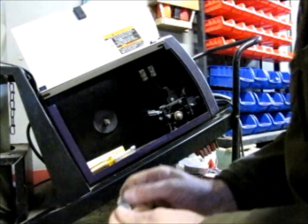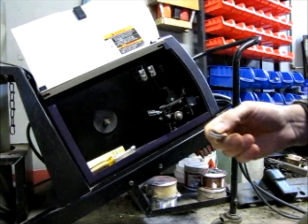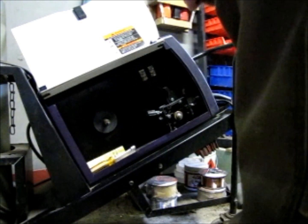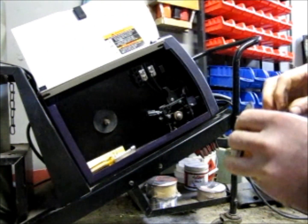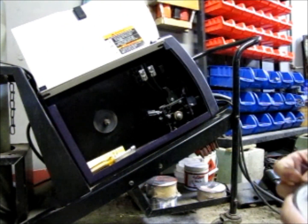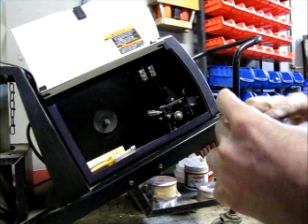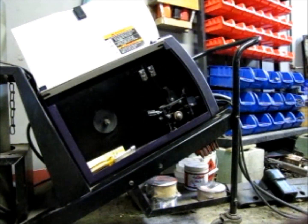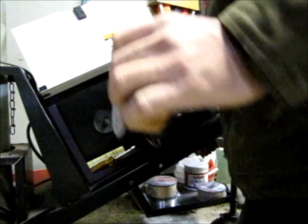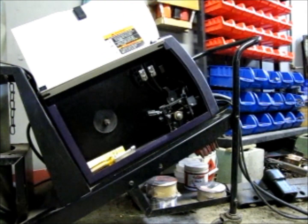Make sure I get my aluminum and my nylon bushings out of there, because I've got to go in the next spool. So then I put my next spool on — make sure that it feeds from the bottom. Now, before I put this on, I've got a little bit of surface rust on this here. I'm going to take a brass brush and knock that off a little bit.